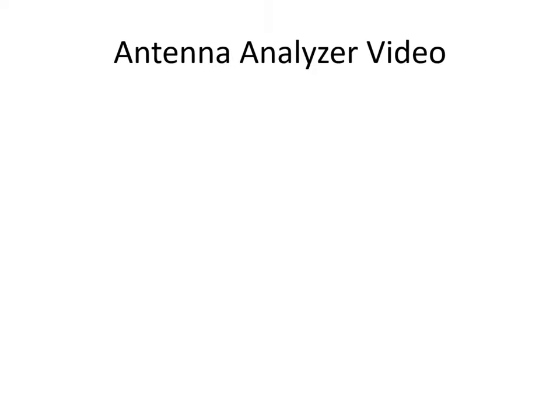I'm going to go over how I used my antenna analyzer to get the SWR readings necessary to adjust the dipole. I'm using my RigExpert AA54 — it powers up with a main menu explaining the functions of each button on the front panel, and you can control everything from the front panel. The antenna connects to the connector on top, and on the bottom is a USB port you can use to connect the analyzer to your computer for additional analysis.